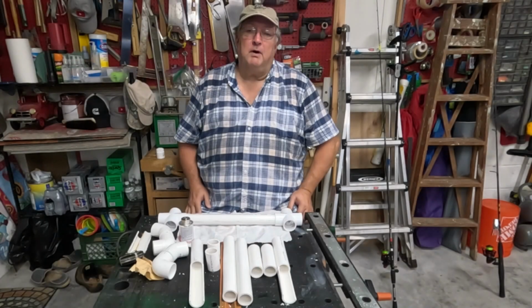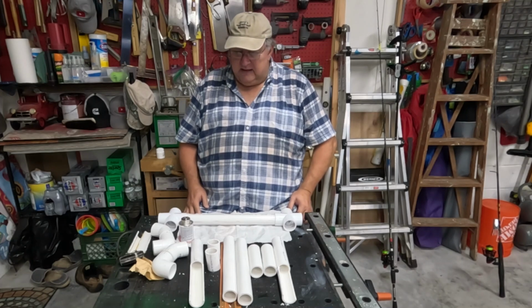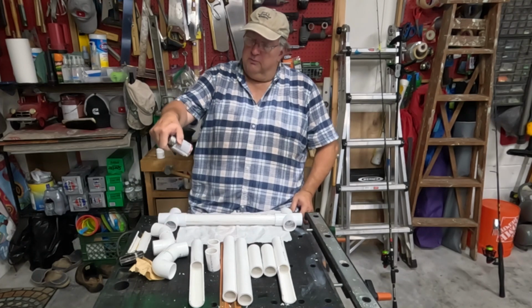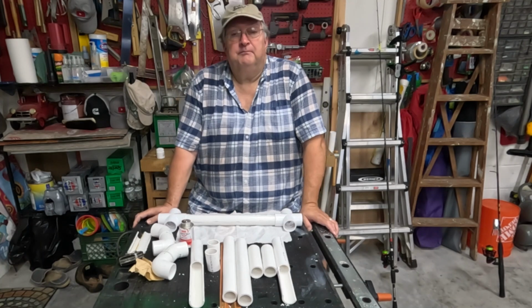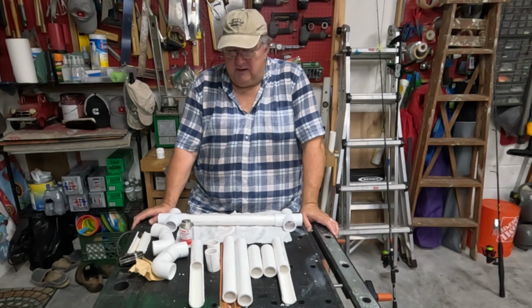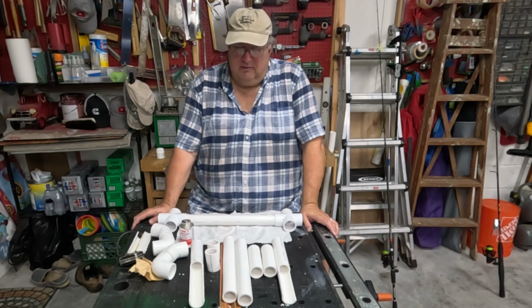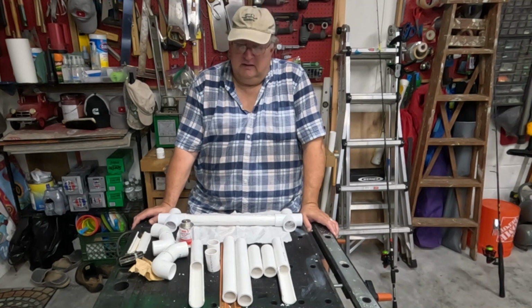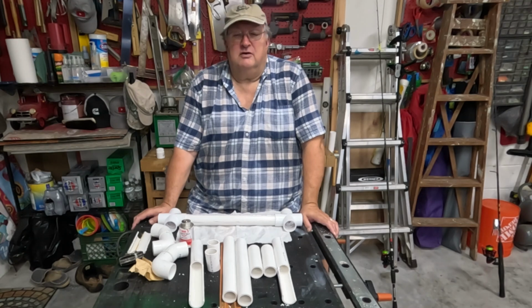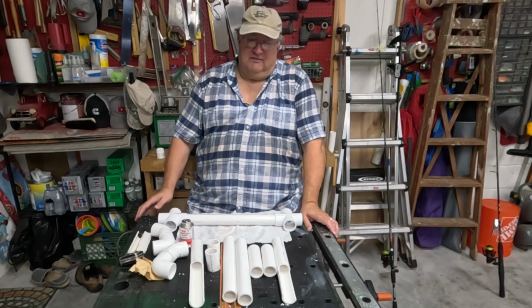We've got all of our parts cut and ready to assemble. So the only thing left to do is take a little all-purpose PVC cement and put these together. In a previous video, when I glued PVC pipe together, I used cleaner, but one of my subscribers reminded me that we aren't gluing together water pipe and having any pressure on it. So really, all we need to do is put some glue on these parts and they'll stick together. We don't need the cleaner for this application.